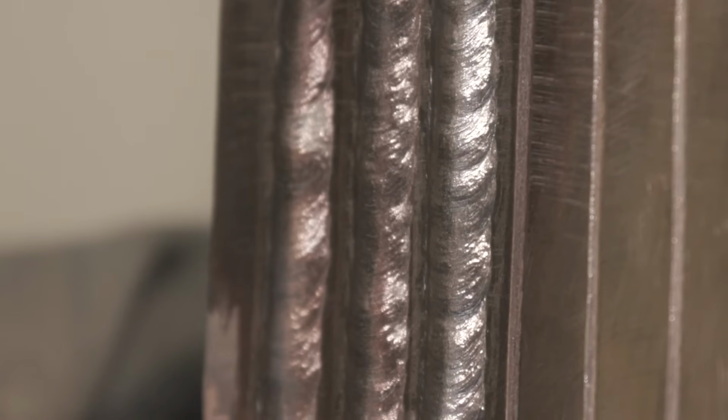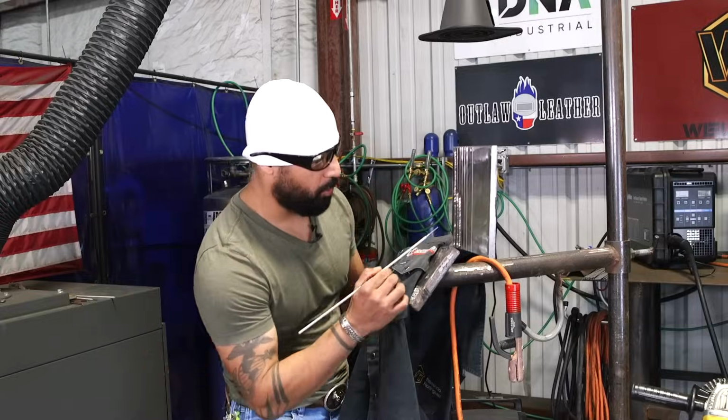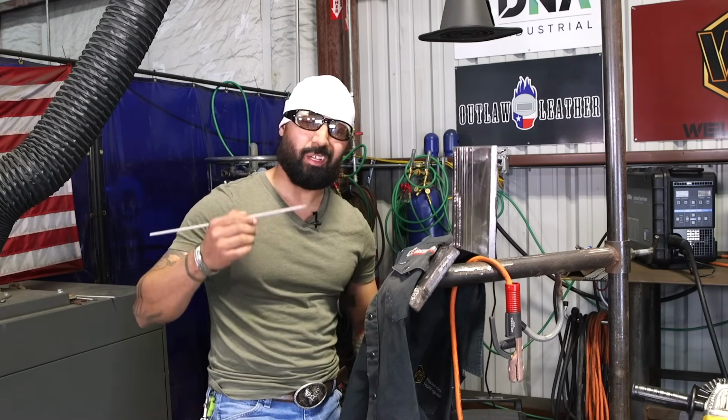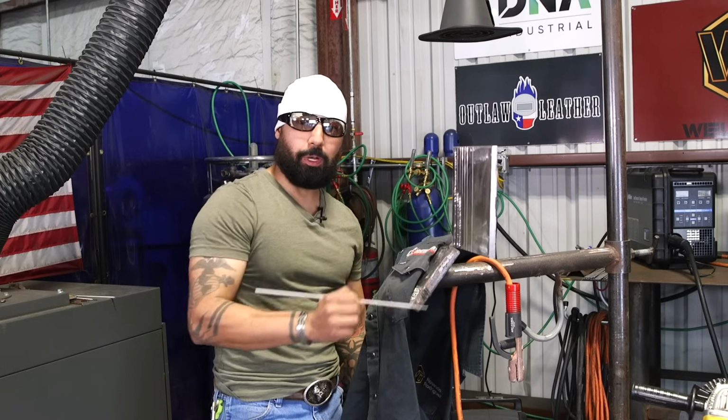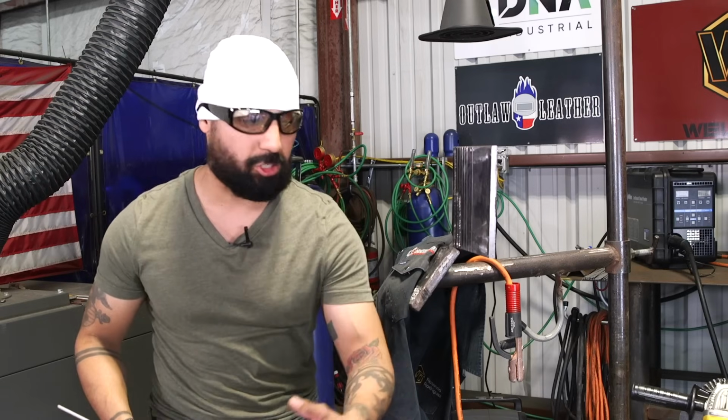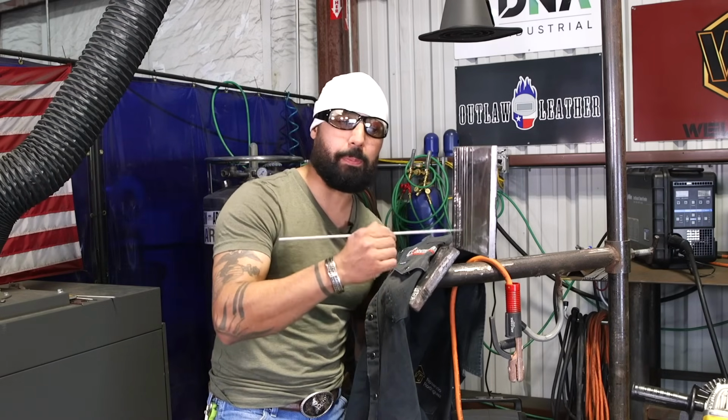All right, ladies and gentlemen, so there you have it. I just showed you a couple tips and tricks, a couple techniques also on how to run straight beads uphill, vertical. Remember, very important, watch your puddle. Your puddle tells you everything. Make sure that you keep it nice and tight, nice and slow all the way through with the proper angle.